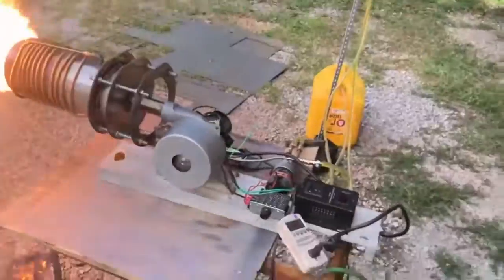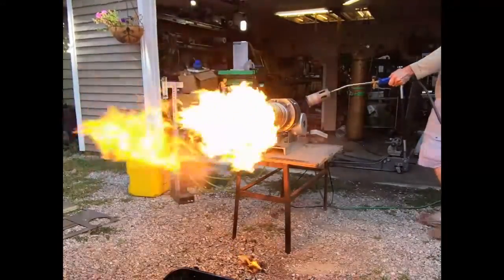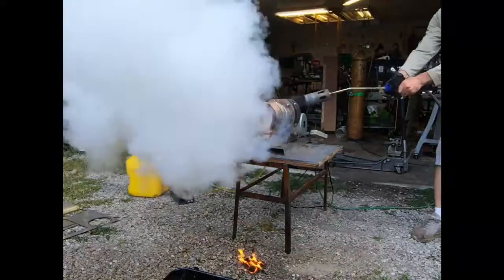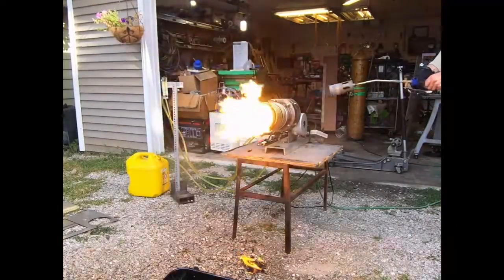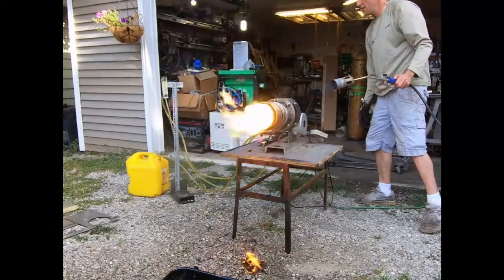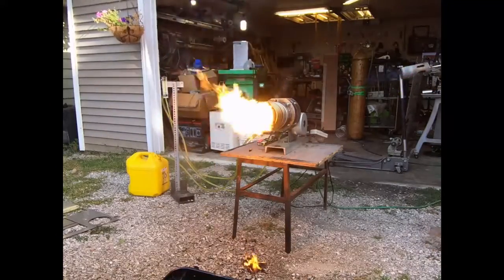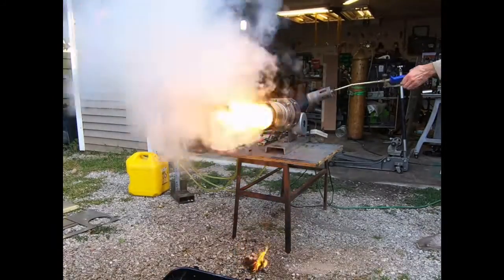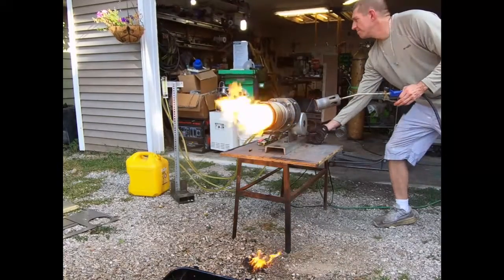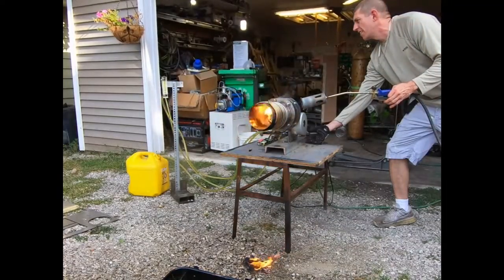It's just dousing too much fuel, and a lot of that had to do with what I think was vapor lock taking place inside the fuel line, but I'm not 100% sure. This thing will definitely behave differently on waste oil — this is a diesel test by the way. I probably should have just gone ahead with the waste oil, because the pump might have been able to pump waste oil at a slower rate since it's thicker.